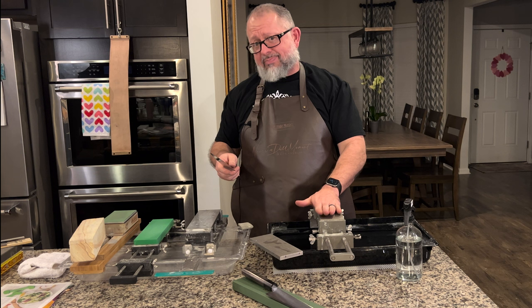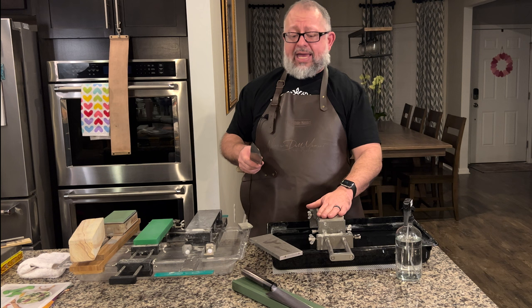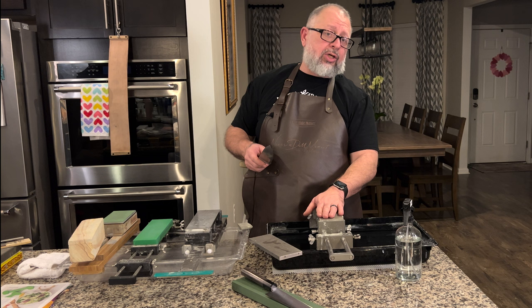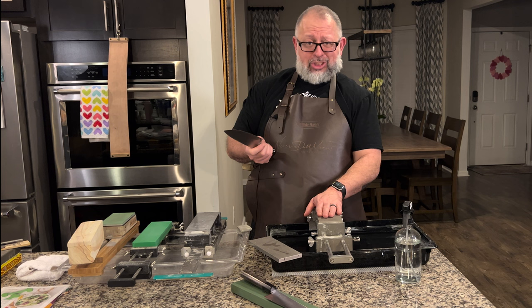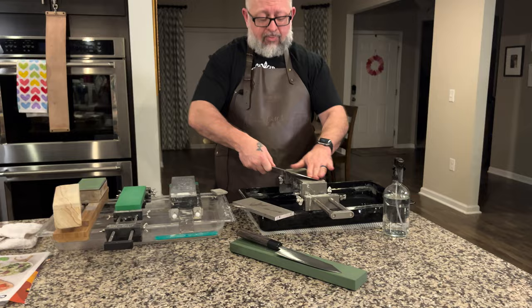A few things to know about the CBN plate: it had to be flattened by Hans to an extremely high degree of accuracy — within microns. There is no flattening stone for an electroplated CBN plate, so it had to come flat. Also, CBN particles become very difficult to use below 1200 grit because as the particles get smaller, they disappear below the nickel during electroplating. So 1200 is the finest available here.